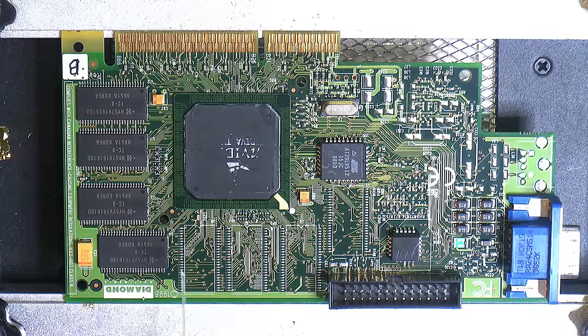Plan here now is to clean up these pads because I'm not gonna hot air the chips. I could probably do that. The chip is very close. Got plastic over here. This could obviously be replaced and so on. But I think it just makes more sense to solder them on.